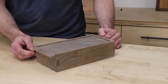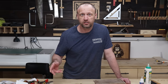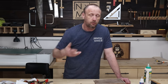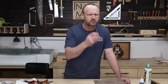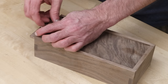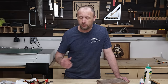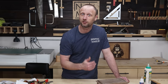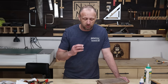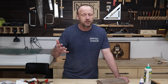That is a good-looking lid. Last thing is something to be able to pull it out. Usually you just take a chisel, cut a little divot in the lid, put your thumb in and pull it out. Or you can do what I do: take a piece of scrap wood the same width as the box side thickness, drop it in place, and it looks like it was always meant to be there. I've made a million of these and never had a problem with that piece being glued across the grain on tiny pieces that don't move much.